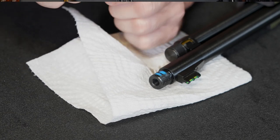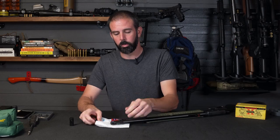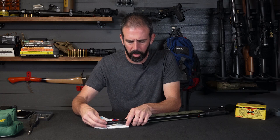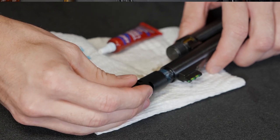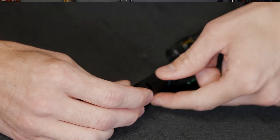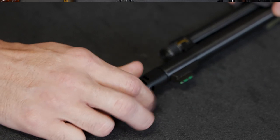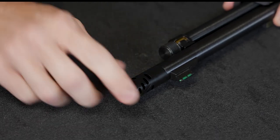You don't have to use blue Loctite — you can use your thread locker of choice. I like the blue Loctite; it works well. There's also Vibratite and the green stuff. Do not use red — you will never get it off. So blue, green, or purple. I'm going to screw this backwards until I feel it catch, then run it on forwards. That sucker is threading nicely. They do such a good job machining these — if it weren't for a slight variation in color, that is a near seamless fit. They do a really nice job.